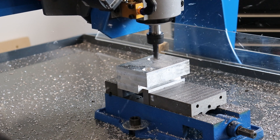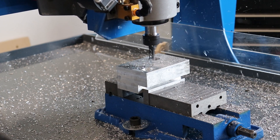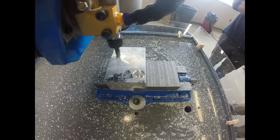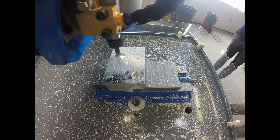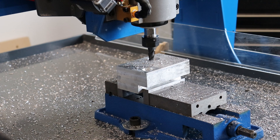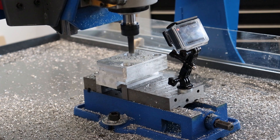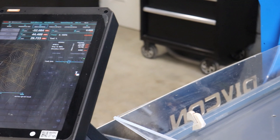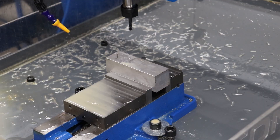That awful noise you're hearing is coming from the aluminum cover panel on the z-axis, which is only held on by two bolts and vibrating against the spindle like crazy. This was fixed when we installed the new panels. Our final step over was too aggressive and it stalled out the machine, followed immediately by poor code having the machine take a full depth of cut at a 5-millimeter step over. After a couple more crashes we were able to complete the cut. There are some issues with my code causing it not to produce radiuses and arcs correctly, but it'll be a while before I figure that out.